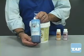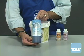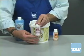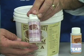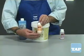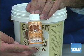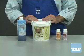Next, we have the hardener. The hardener is dyed blue so that you can tell when the hardener and base are thoroughly mixed — there will be no streaks remaining. The hardener has a 6 to 8 hour cure time. The system also includes a thixotropic thickener, used to make blanket molds. Finally, we have a thinner which can be used to reduce the viscosity of the silicone and can also be applied to the finished mold to extend its life. This video will focus on the silicone and hardener only.